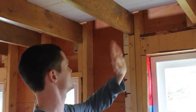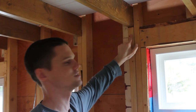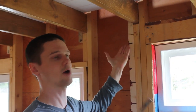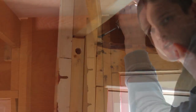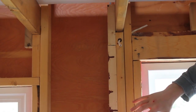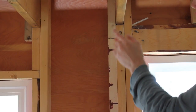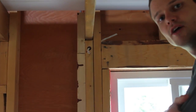The framing is going to come right up under this joist and against this solid stud. So I'm going to try some fancy drilling here to allow the wires to come and enter what's going to be the wall. I'll show you how I'm going about it. You can see how I drilled straight in and then drilled at an angle to meet up with that hole, so now we can pass cabling from the framing through the hole. When it comes time to frame this room, the stud that's going to go right up against here — we'll just pre-drill a hole and sleeve the wires through as we bring it up, and then those wires will be inside the framing of this room.